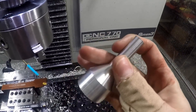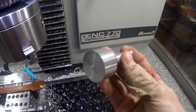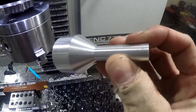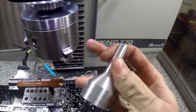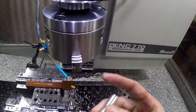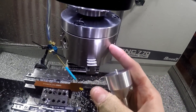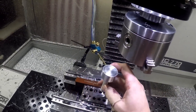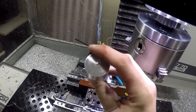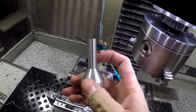The parting was a little wacky — it was just vibrating like crazy and freaked me out. I'd probably have to optimize the feeds and speeds on that. I'm not sure how lathing feeds and speeds go in a production environment. I would run all of this stock piece basically with a mill-lathe setup, then swap in the regular R8 collet back in, make soft jaws, line these babies up — and this gets a big pocket in there and threaded down with an M12 by 1.25, and from here down about a half inch gets threaded with M12 by 1.25 as well.